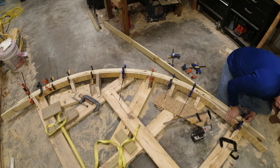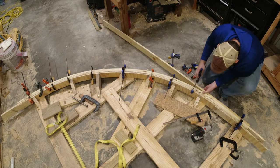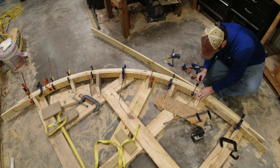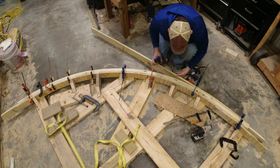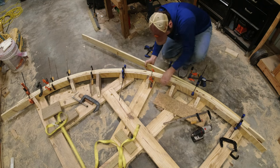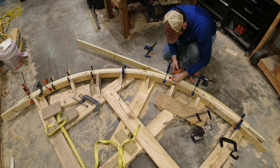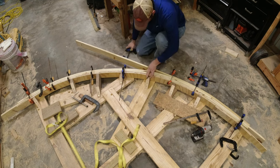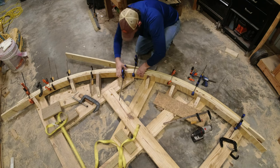A lot of this construction was rinse and repeat for each new board I was putting on, using a combination of quick clamps and screw clamps. You did have to watch that as the board was being bent, sometimes it would want to twist — kind of bend under or bend up, not staying flat with the others. So I had to make some adjustments as I went. I'd get a few clamps on, take the clamps ahead of it off, and reattach new ones further down the line, so I wasn't removing too many clamps at once — just marched my way down the arch.